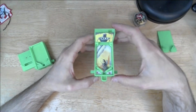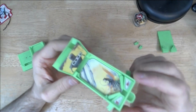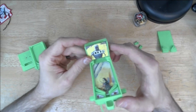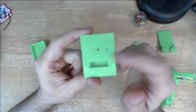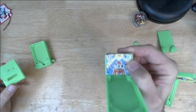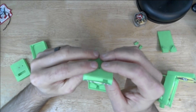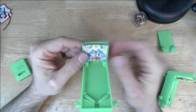So printing all that out and assembling it again led to this version. So there's not a lot that's super different here. I also made some minor changes to the inside of the back panel. Because this version of the back panel spun really easily, but this version spun not quite as nicely. So the differences were that there was a little bit of thickness added by the sticker. And I also tried having 5 fins rather than 4 inside, and I think that also didn't work as well.